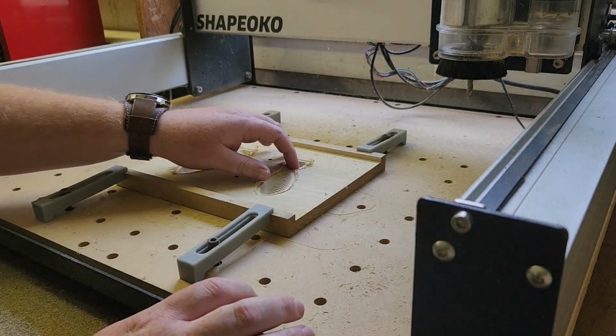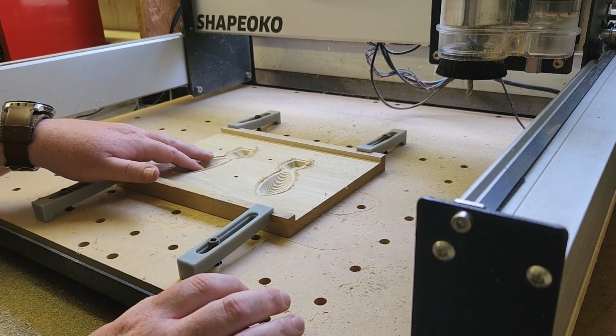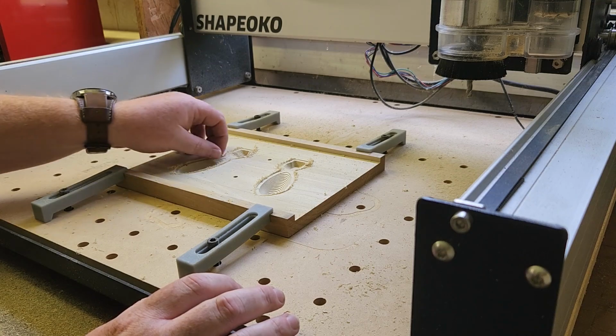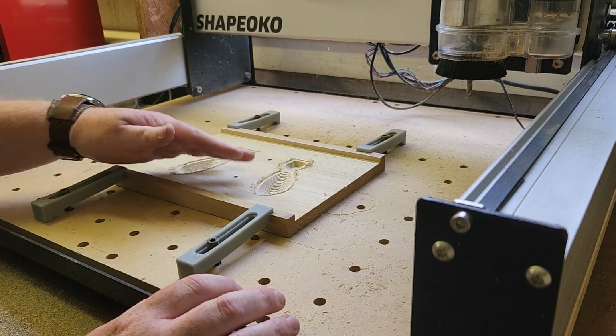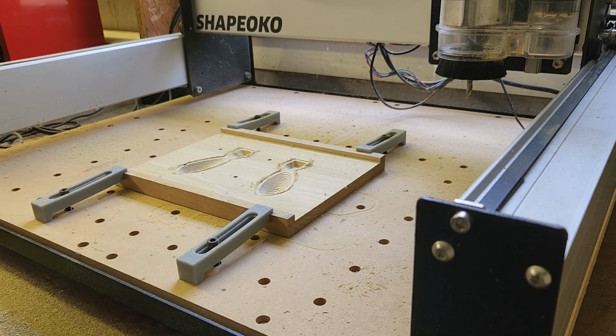Okay, you may notice it was kind of burred up on that first pass. I think that's a downcut end mill. I didn't really check. I just threw one in there and hit the go button, but I ran a spring pass to knock all that excess rolled up material off, but it's nothing that won't sand out. Let's move on to the finish pass.